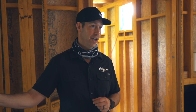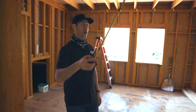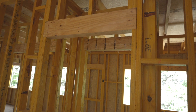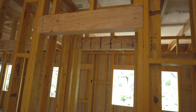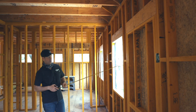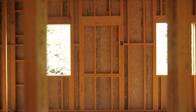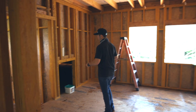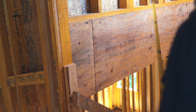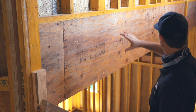I also changed from the original eight-foot ceilings to nine-foot ceilings when I reframed — nine feet is beautiful. We did headers in all load-bearing walls as well because I've got roof load coming down on them, and I ran all header stock for exterior windows in LVLs too. This is a two-story pop-up that we framed entirely with LVLs, and look at that big two-foot beam — made by Roseburg — it's a double-ply beam carrying all the roof load all the way across.